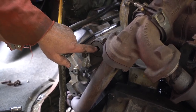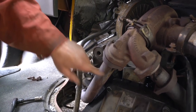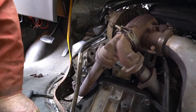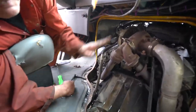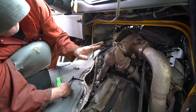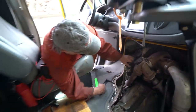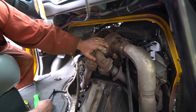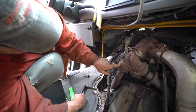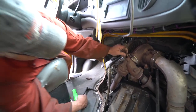These plugs on the back of the head — these are the ones you take off to drain the oil out so it doesn't go in the cylinders. Just remember that's what that plug's for, because these are HEUI injectors and they're fired by oil. You take those plugs out before you take the injectors out, and that way you don't get oil in the cylinders. If you do get oil in, it's not a big deal — you crank the engine over three or four times and it'll go away. There are three bolts that hold the turbo down, so we're going to take that off and take this Y-piece out of the way, and that'll give us enough room to get the turbo without bothering the exhaust.